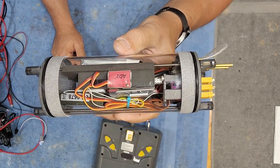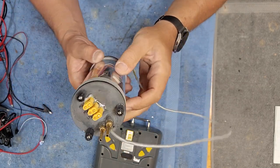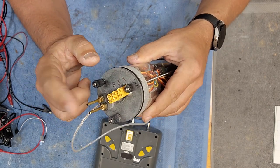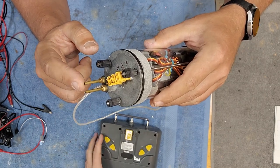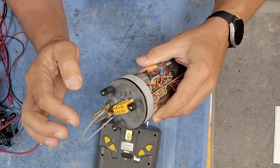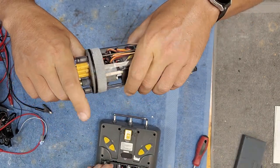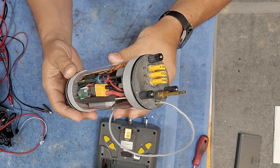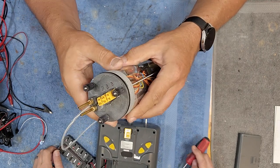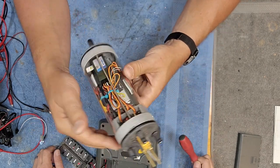There's also the electronic pitch controller on the side of the unit. This particular cylinder has two outputs. What you're gonna get has only one output unless you specifically reach out for two outputs - there's an upcharge for the additional servo seal and linkage. With two outputs you could potentially have your two jets work independently, so you could do barrel rolls in theory. Also, rather than XT-30 connectors you may have bullet connectors - it's the same thing.